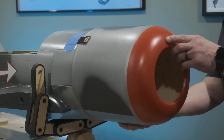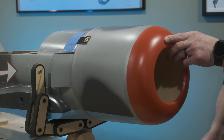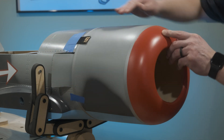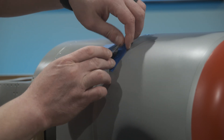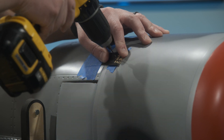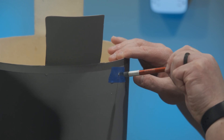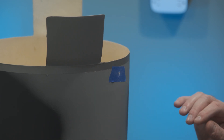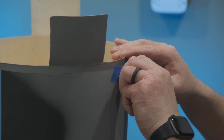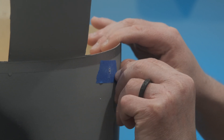Because of that ridge, there's really no guesswork. The only guesswork is rotational alignment. You can use the light blue at the bottom to line up the line between the blue and the gray to find exactly where you want it. Get some pieces of tape and get ready to drill. Whenever I drill through fiberglass, I do it through a piece of painter's tape — it just makes the holes a little bit nicer. Then we'll take the cowl off, use a hobby knife with a really sharp brand new blade and rotate it around. This looks elementary, but it really enlarges the hole very nicely until we get a good fit of the bolt through there. When we're satisfied, we'll take off the tape and see a nice clean hole with no damage to the paint.